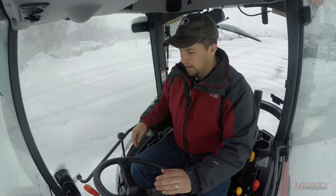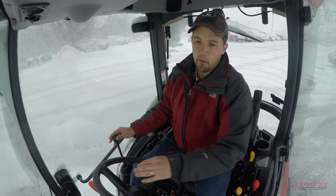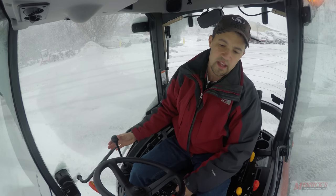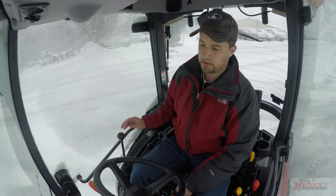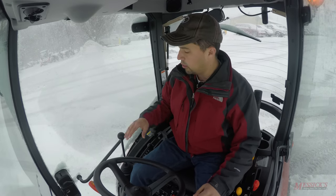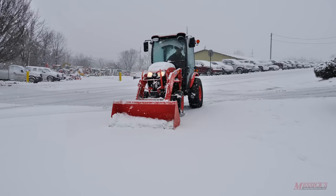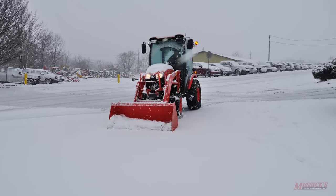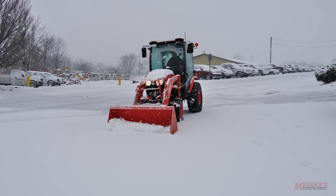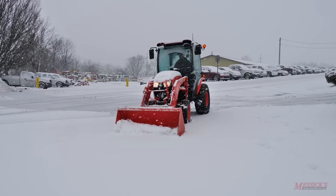We're going to come out here to this parking lot. I'm going to run my tractor at about half revs. What I want to do when I bring my loader over is take my loader bucket, level it out, set the cutting edge down on the surface of the driveway, and then float my loader. When you float — if you're not familiar with float — on your loader stick, you want to push the whole way forward. There's a point where you go from pushing it down — you can see I'm lifting my front tires off the ground — and you're going to push through a detent. When you push through that detent, it opens up your boom cylinder and allows your boom to ride up and down with whatever surface you're going across.